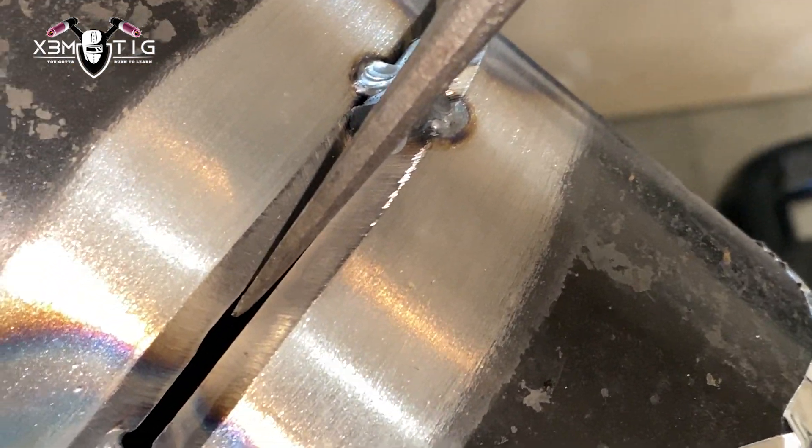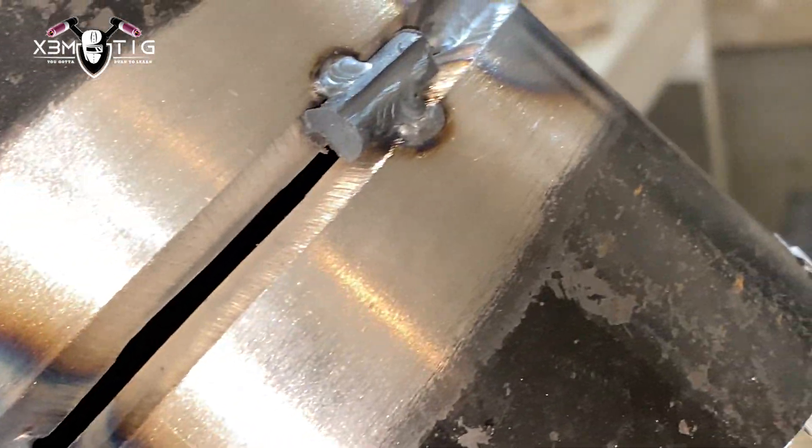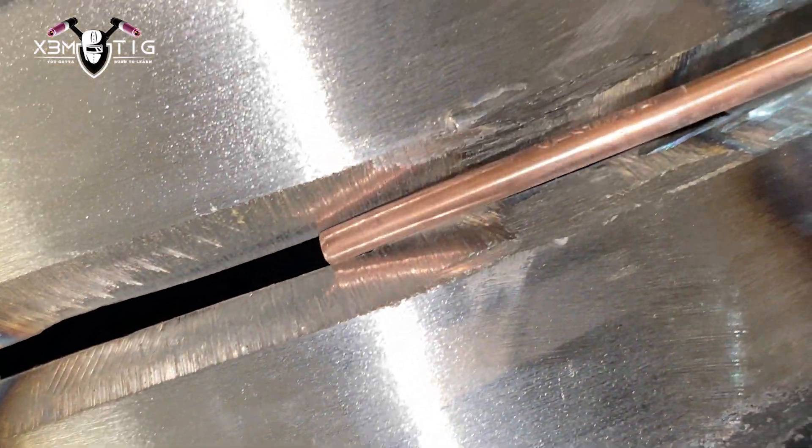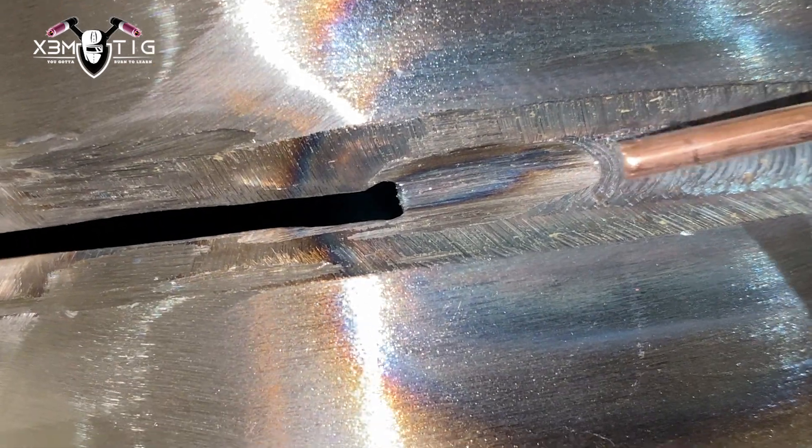Hopefully maintaining the same gap — always keep an eye on both edges, make sure they're both being consumed, and add rod as needed. With the keyhole or dipping technique, the amount you're depositing won't be too excessive or too heavy, so you won't have any drips inside — that's why it's always good. The gap is pretty much the same; I'll pull the wedge out now, remove that tack, and feather out the tie-in points. It shouldn't shrink any further — it'll stay the same. Once I reach that tie-in point I'll go over half an inch and finish my root pass.